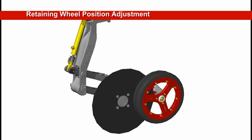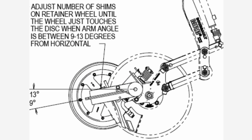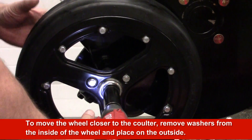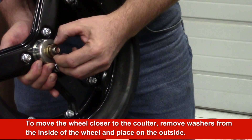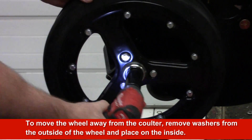The retaining wheel can be moved in or out by adjusting the amount of washers on the inside of the retainer wheel. If the wheel is positioned too tightly against the coulter face, the coulter may have difficulty turning, resulting in a poor furrow profile. If the wheel is positioned too loose, it may not clean the outside of the coulter sufficiently. The factory setting is for the retainer wheel to just contact the coulter face when the arm mount is positioned 9 to 13 degrees from horizontal. To move the wheel closer to the disc face and furrow, remove washers from inside of the wheel and place them on the outside. To move the wheel further from the disc, move washers from outside of the wheel to inside. Take note when removing the retainer wheel from the mount to account for all the small washers.